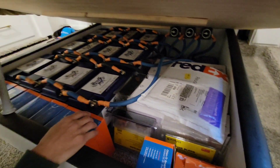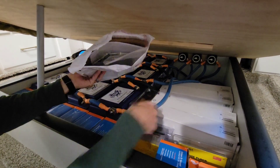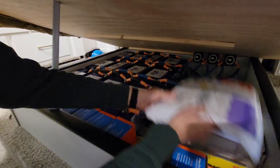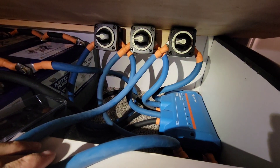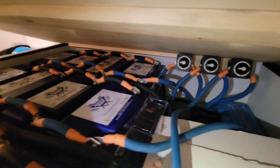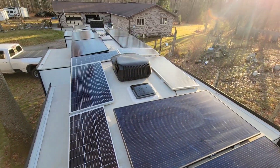There's also other equipment under here — these are things we carry for installs: solar controllers, DC-to-DC chargers, autogen start modules, Lynx Distributors. It's just RV life — you store stuff wherever you can. It's hard to see down in there, but there is a Lynx Power-In where all the groups of batteries come together. Each group's positive and negative connect there, then it goes down to those four heavy cables connecting to the Lynx Shunt.